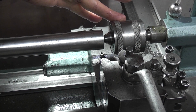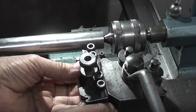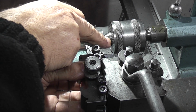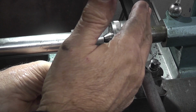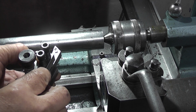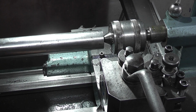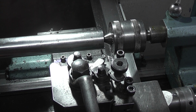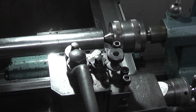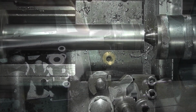With this revolving centering, I have a problem. When the tool post is the normal way, tool on this side like that, I can't get the tool tip further enough back without angling the tool post, which then makes it awkward when I come down here. So what I've done is just put the tool on the other side so that I can now come into the face, and I only need to go along 70mm, which is about there, machine this diameter.